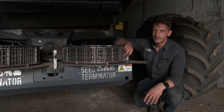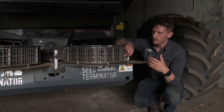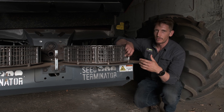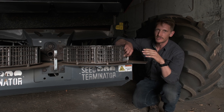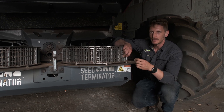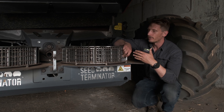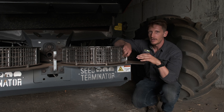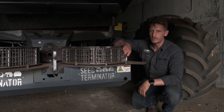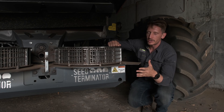And I think over time, having a few discussions with Mike Walsh over the years, I've come to realise that although 90% is a lot of the weeds, killing those last 9 or 10% is actually really important when you consider that the combine harvester can spread these things for hundreds of metres. It's not necessarily the total number of seeds you're letting through with those last survivors, but the fact that you're spreading them so far. And when we talk about herbicide-resistant weeds and moving them through a field, those individual seeds could be the ones that in the future cause you a lot of grief in the farming system. So that's why these high kill screens are used to kill all the seeds.